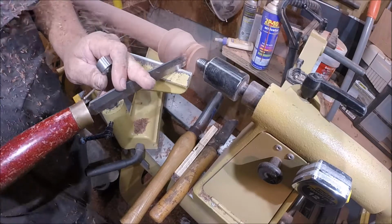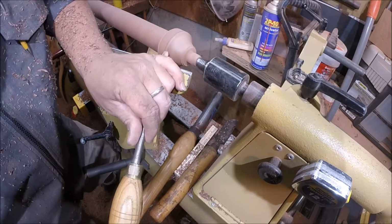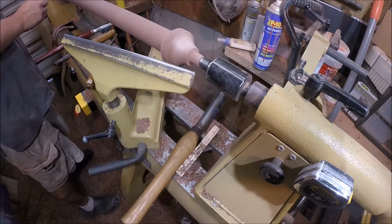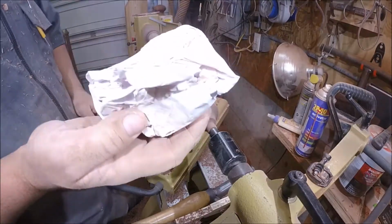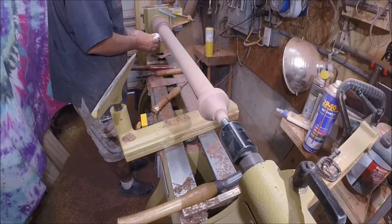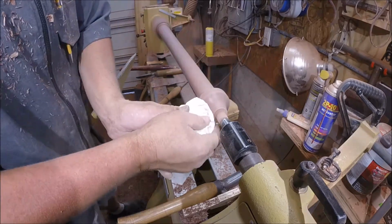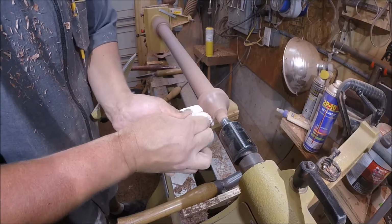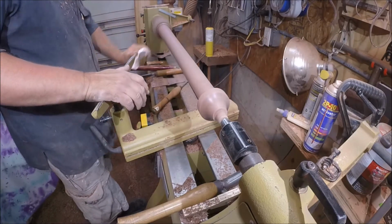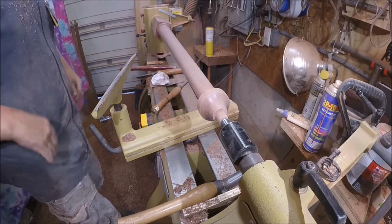Quarter-inch parting tool to make the 3/4 pin to accept the handrail when it's installed, and finished up the last big cove with my detail gouge, 1/4 inch. Definitely won't bore you with this sanding. I like to buff all my pieces when I'm done. I use a crumpled up old piece of paper, or the chips off the ground work well also. That'll do, pig, that'll do.